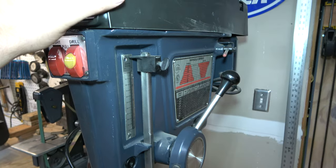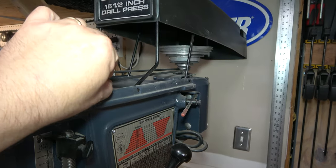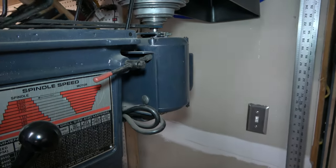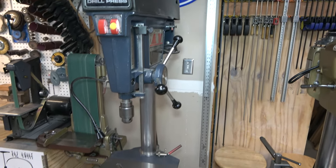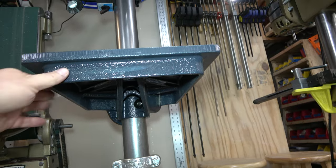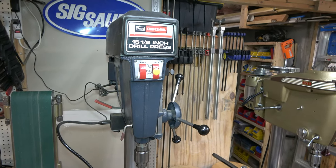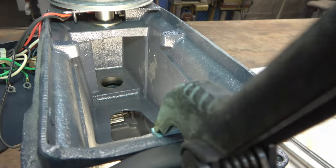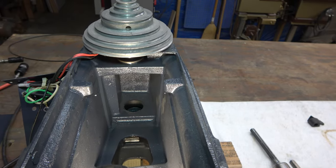The integral belt cover, the 6-inch 8-step pulleys with the 3/16ths by 45-inch belt. The motor mount and how you adjust it — very simple design. The Gen 4s ran for about 10 years and are probably the most common of the Craftsman drill presses you can find on the used market. Looking at a Gen 4 head on the inside, just to show that it's almost the exact same design: there's your roll pin, there's your spring — so it's just like the Gen 1.